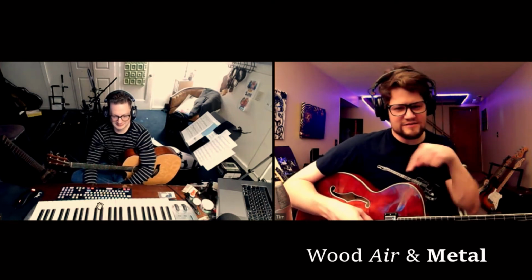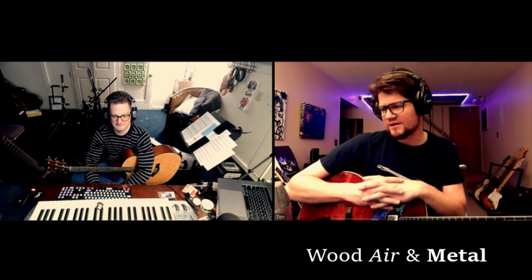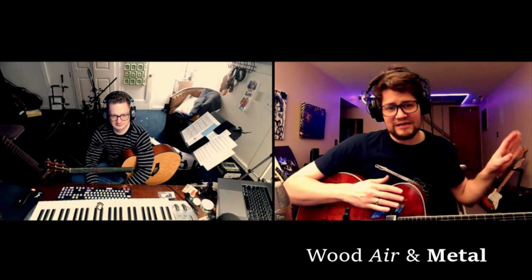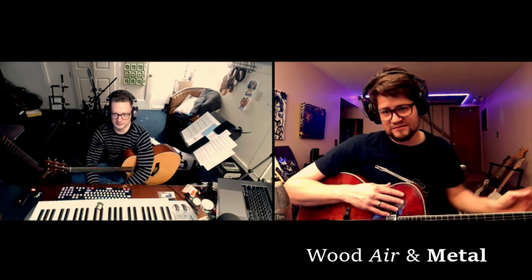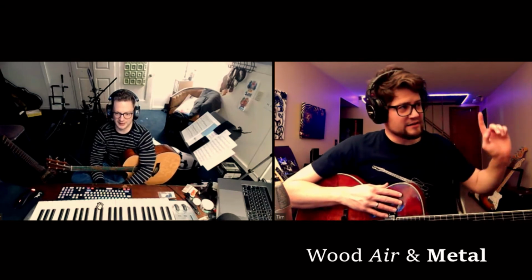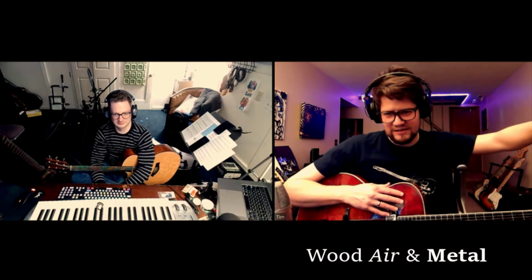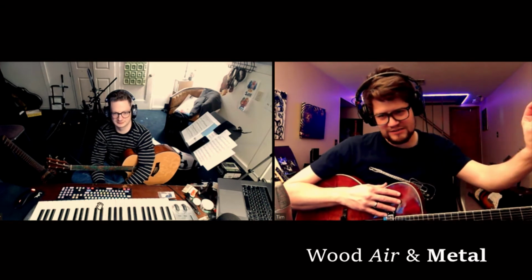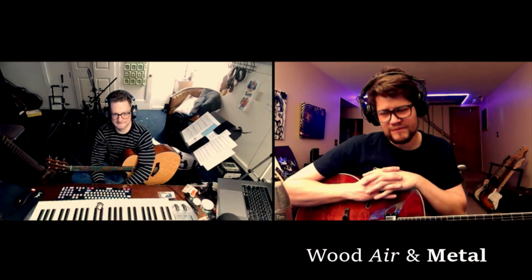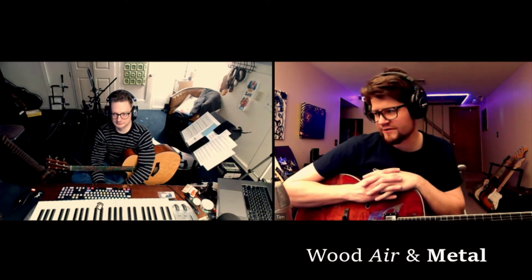But this is kind of a hard guitar to do it in. Other guitars, you end up changing pickups out, changing pots, resoldering because something got loose. And this isn't even getting into amps. That's a whole other huge field in terms of repair. On the Mesa, I broke off a couple knobs because I had it in my car and I moved or something and it knocked some of the knobs off. It broke them at the stem, so I had to change the pots out. That was interesting. The soldering iron really helps on those kinds of things. You just look at how it was done before and then redo it.